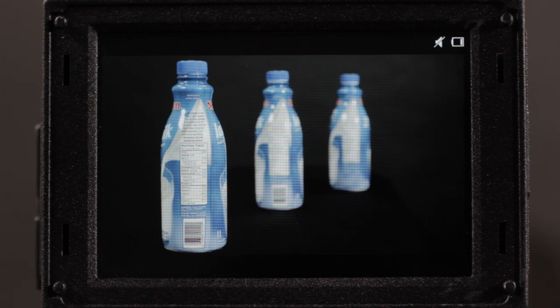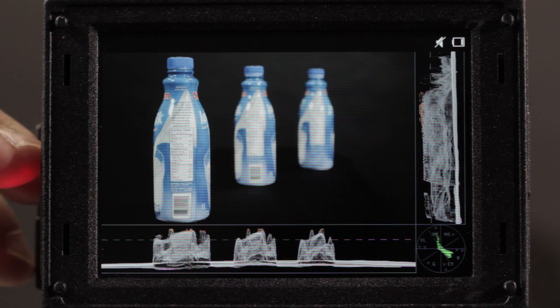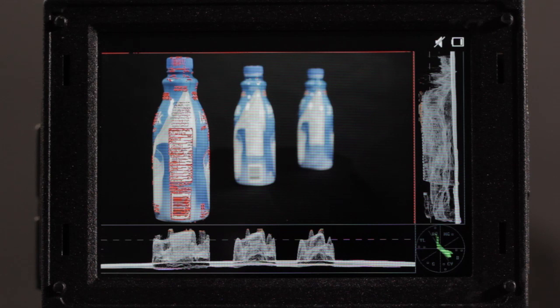As we can see, the EVF4 RVW is really a full-featured monitoring solution for the professional cinematographer. Through the various filters for setting exposure, such as the waveform, you can even stack filters — for example, waveform and peaking on at the same time, so while you're filming you can monitor both focus and exposure simultaneously. There are also crop guides built in for 2.35:1, 1.85:1, and others. You can put the image into monochrome, fully color balance the screen, and there are color bars available. It's a complete monitoring solution for anybody serious about their filming. For more information, please visit our website at www.cineroid.ca.